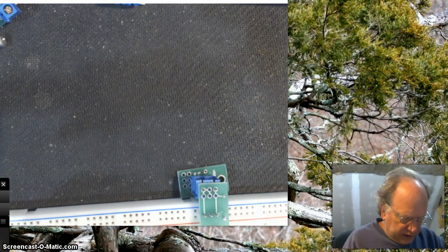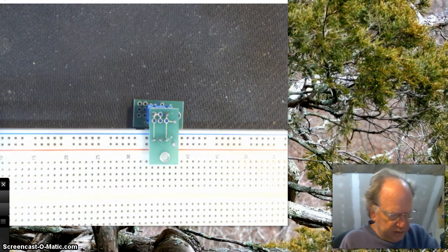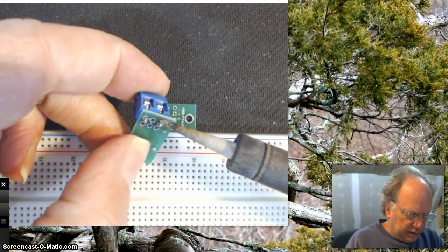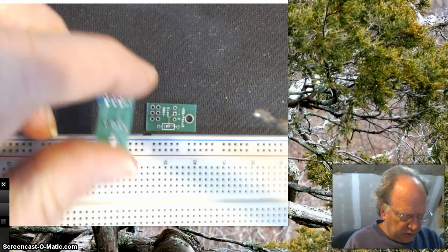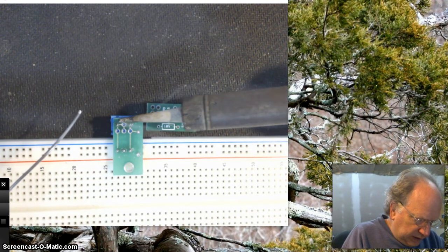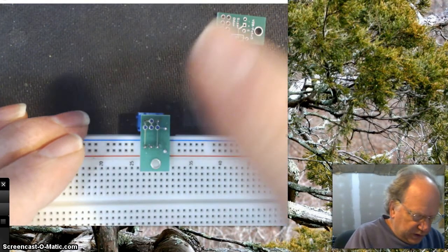And now I'm going to put a dab of solder, a little bit more to the center, on one of these. Again, please, please, please don't solder them both. Make sure, oh, look at that, see it's tilted? So this one's easy. I'm going to go ahead and heat this up again while gently pushing with my other finger. And now it's sitting flush. It looks great, so I'm okay now to go ahead and put that other dab of solder on this remaining pin. These things are relatively massive. They sometimes take a little more heat, a little more time to actually get them to melt all the way down. So once you've got that, you're good to trim this off.